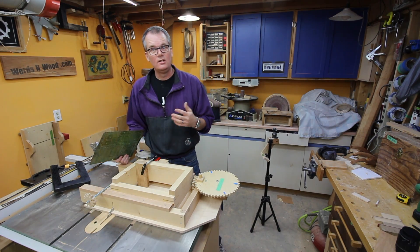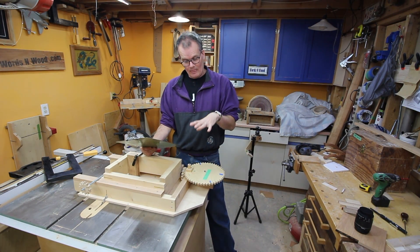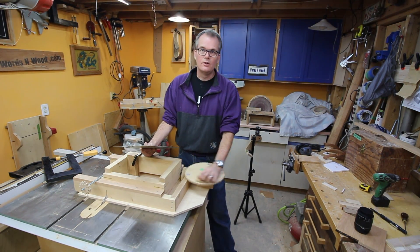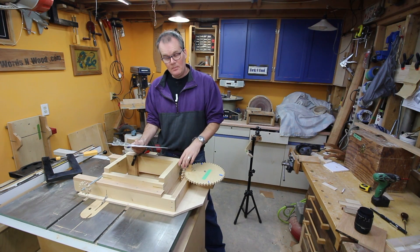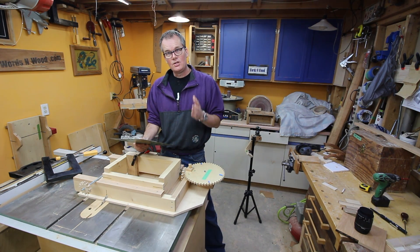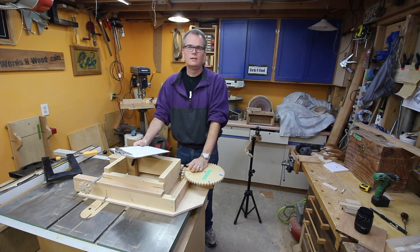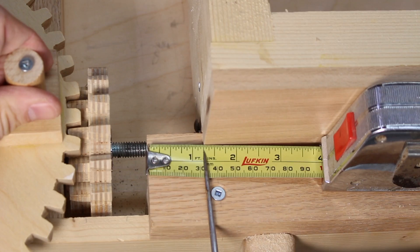In my first example I'm going to be cutting a basic quarter inch finger joint. Here's our first bit of math: I've got a 48 tooth gear turning a 12 tooth gear which is turning a 16 TPI rod. 48 divided by 12 is 4, so I turn this once and that turns the 12 tooth gear four times. That means the rod is being turned four times because they're attached together. There are 16 threads per inch; 16 divided by 4 is 4. So four turns of the rod moves the carriage a quarter inch. If I turn the big gear once, that turns the rod four times which moves the carriage a quarter of an inch.